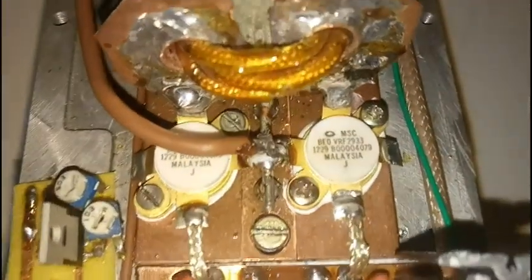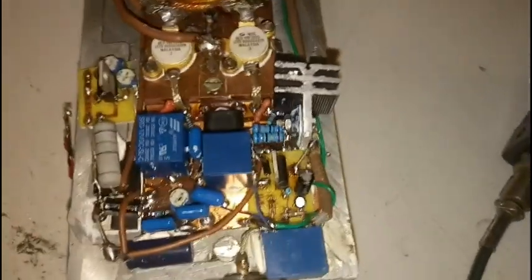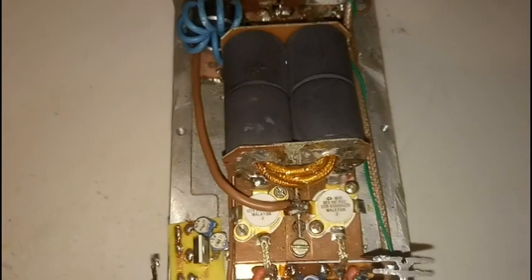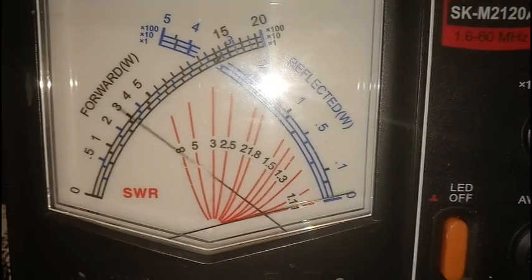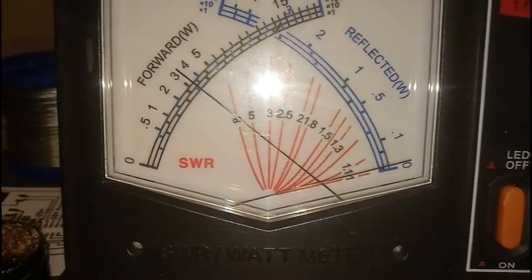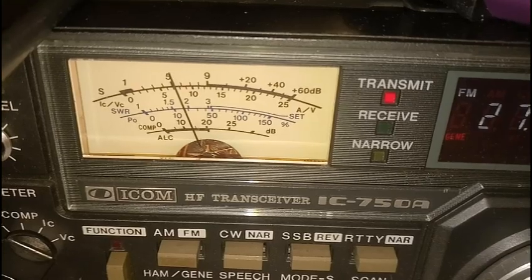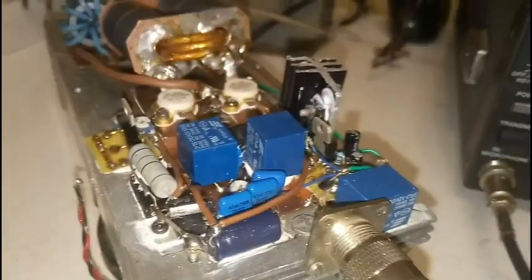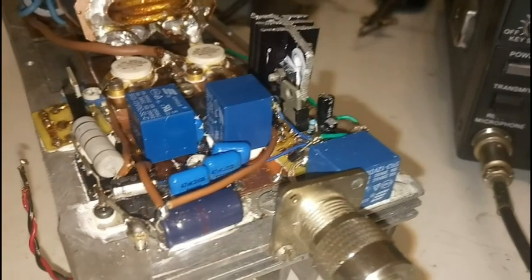Just one very short test — if it's a CB amplifier, it must be run in a truck, isn't it? This test is using a voltage supply of 28 volts, just as a running truck with a normal charging system. For 28 volts, the power is 350 watts. 350 watts in a truck is a nice power — the driving power for that is about 15 watts, and in this regime the amplifier will work forever, will never die, I think. Thanks for watching, goodbye.